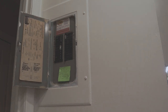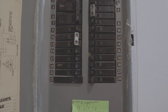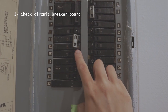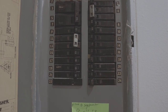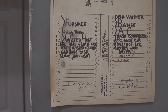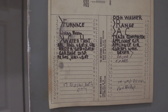From your kiln specs you should work out how many amps your circuit breaker should be. Circuit breakers can only handle about 80 percent of their overall amps, so for my 16-amp kiln I needed a breaker size of at least 20 amps. Thirdly, I checked my circuit breaker board at home. Standard US outlets have 15 and 20 amp breakers, and there are also non-standard outlets with breakers from 30 to 50 amps — the higher the breaker size, the thicker and higher quality the wiring, meant for heavy-duty appliances. Identify the outlets you can use by matching them to the legend on your circuit board.